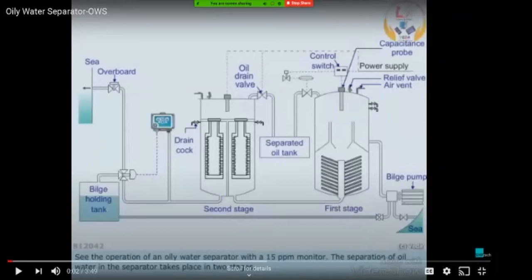For the inner side, you can use a pressurized water jet system to simply flush through the impurities, and those will come out. This regeneration will take approximately 2 to 3 hours. Then the unit can be boxed back into the system and used as usual. Here the accumulation of the solid particles, or oil basically, is on the outer side, which is here, in the first stage out of these two.